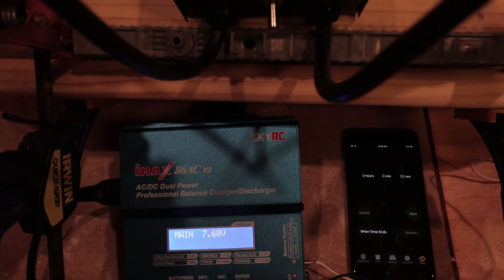One of the key things is finding out what 'normal' is. You really want to get all 28 — or whatever the pack size is, maybe 32 — cells, charge each one up, load test each one, and record all the values. Then you can say: of all these, maybe three are outside the mean — those are the ones you get replacements for. Load test the replacements too. When you rebuild the pack, nothing under load will be drastically different from the others. That's the idea with rebuilding a pack.